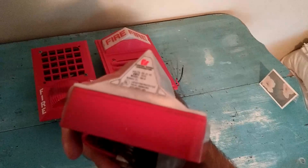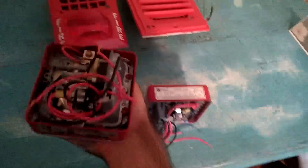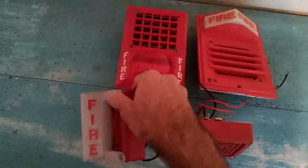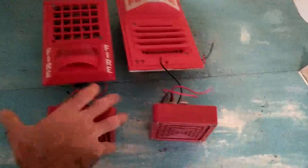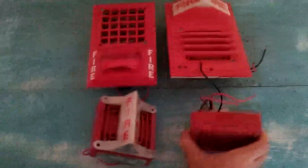Now this is also a horn strobe with a model VALS, or VALS VisAlert strobe, Series T1. I'm not sure if you can see it with the poor focus of the camera. This is a full horn strobe — and what I mean by that is this is not a retrofit strobe that's been wire-nutted on, but is actually hardwired and soldered into the horn contacts right here in parallel. The difference between these and Wheelock's 7002T is that this strobe, if I were to cut the contacts and run it separately, it would actually work. This is an independently running strobe, not a parasitic one. So this horn will not skip when I power it up. You'll also notice that there are four wires coming out of each of these, which makes them easier to wire up so you don't have to crowd the wires all together under the same wire nut.